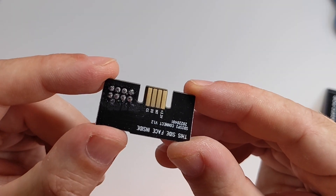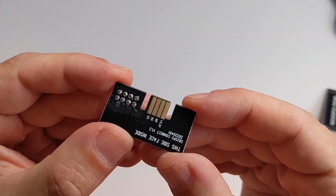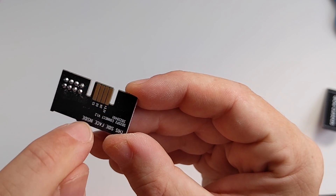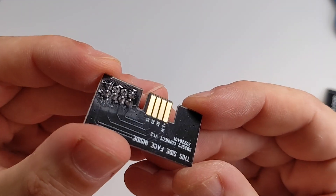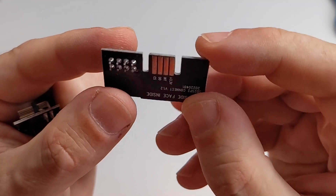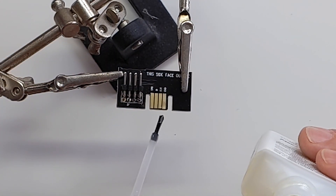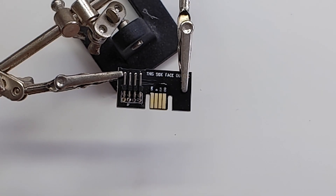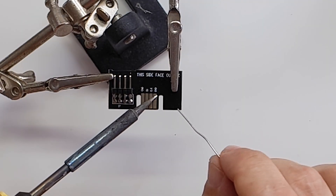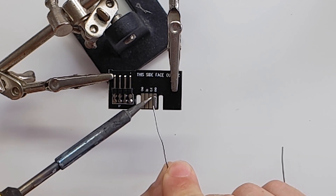Secondly, we've got this part which is like the original PCB but it's very thin, so when it's in place it just wobbles too much and you don't get a secure connection. We need to make it a little bit thicker by adding solder to these surfaces on both sides — or you might get away with just one side. Adding solder onto these isn't particularly difficult. You'll need a soldering iron, some solder, and flux will help the solder flow a little bit better. Basically you need to heat up these metal strips, add a little bit of solder, smooth it out on the surface and try to get it as even as possible. You're not getting a big lump on there — just a shiny extra surface.